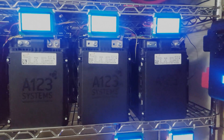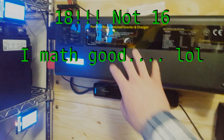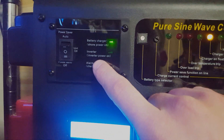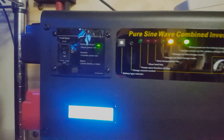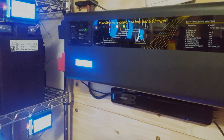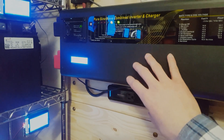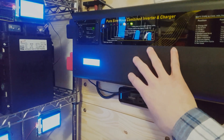Project Overkill now has about 16 kilowatt hours of usable energy. The inverter is 88% peak efficient, so that draws down on it — but with the power saver mode, it's automatic and senses loads. It uses about 48 watts on standby with the inverter on, but with power saver it sends a short pulse about once every second to check for a load — like a sump pump for instance. If it senses a load, it turns the inverter on, so it uses significantly less standby power.